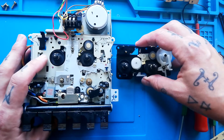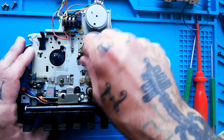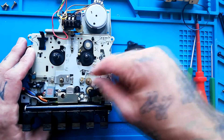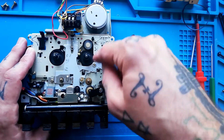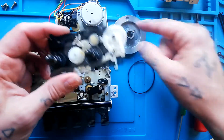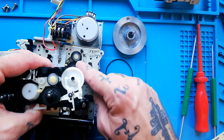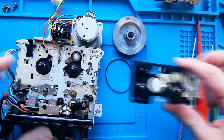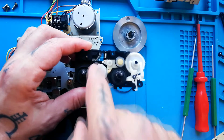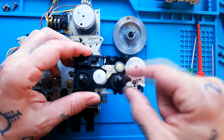I've already done a separate video about troubleshooting playback in this style of transport. One of the things that can go wrong is that this idler wheel doesn't turn the take-up reel enough, so even when the pinch roller is connecting with the capstan drawing the tape through, it just builds up here or you get tape spill. One of the things you can do — having first made sure that the belt running from the flywheel up to this part is good, and having first replaced this idler tire, which I've demonstrated in another video with a link in the description below — is to clip this spring here so that there's enough force pushing the idler wheel against the take-up reel.